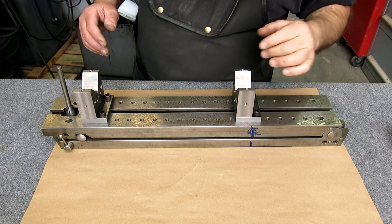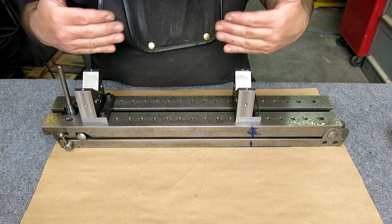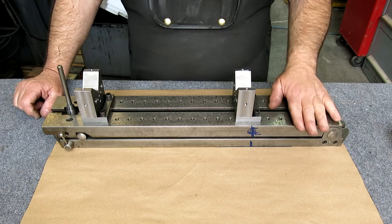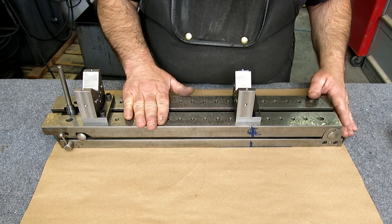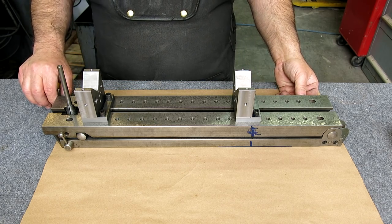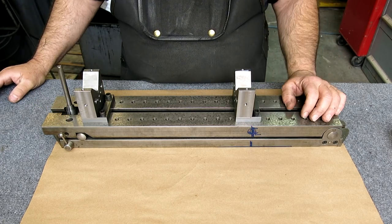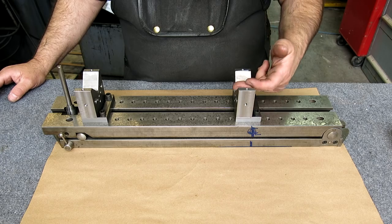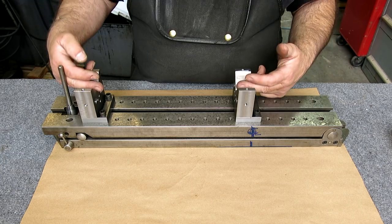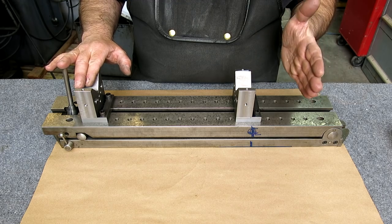All right, this is the grinding setup. I needed something basically functionally a really long V-block to hold the rod in here. And we'll plop the rod in here in just a minute. And my friend Andy had given me this, it's a 20 inch sine bar. And so I just built some V-block setups here that the rod's going to run in. I don't want to run it on the centers. I want to run it on the OD of the rod. So I want to reference that when I grind the plane on the bottom of the foot.